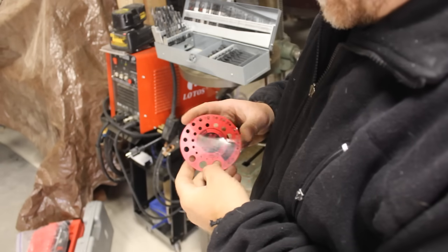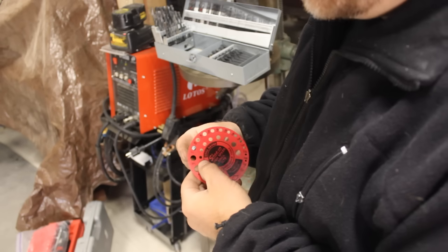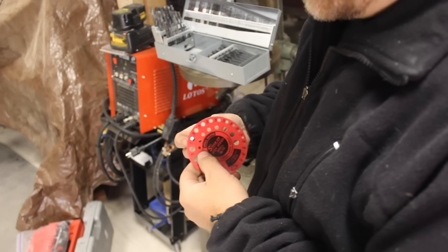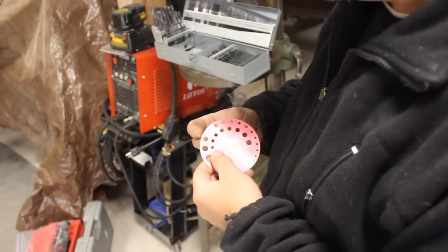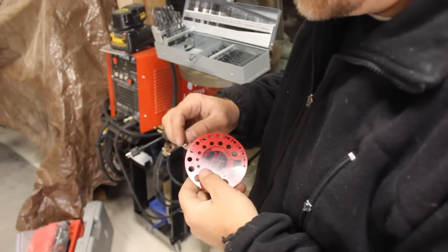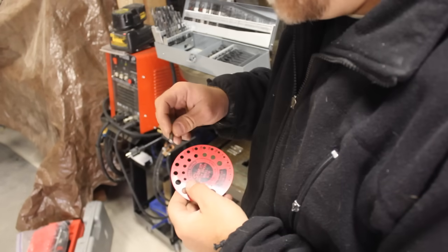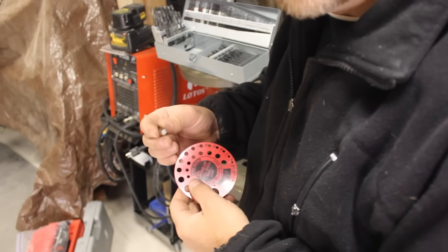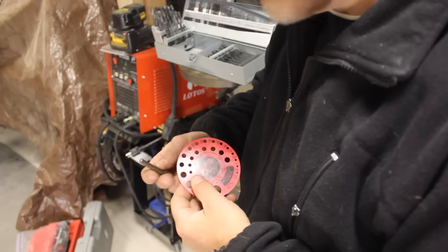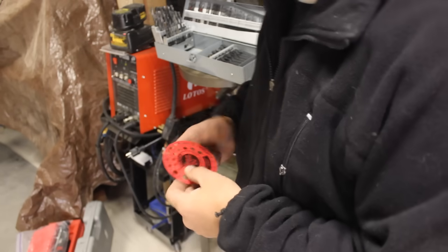I've also got the Snap-on drill bit gauge, and this doesn't quite fit through the quarter inch hole, which would jive with our calipers. So I've got a quarter inch there, the next size down is 15/64. And I do have a drill bit that size. I think we're going to start with the 15/64 because these drill bits tend to not drill a super clean hole. Let's start small and see how tight of a fit it is. And if we need to bump it to the quarter inch, then we'll just come back and hit it with a quarter inch. I just want to make sure I don't drill the hole too big or I'm kind of screwed. So let's start there.